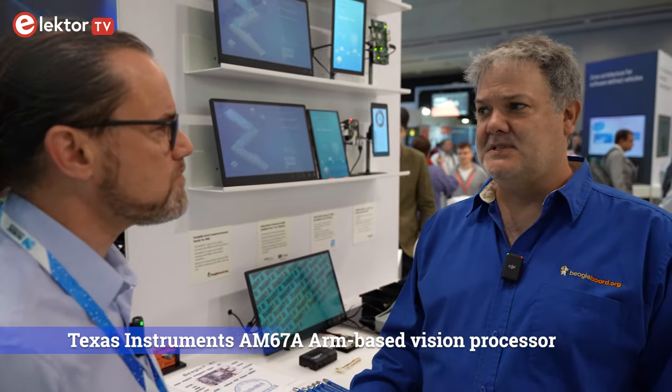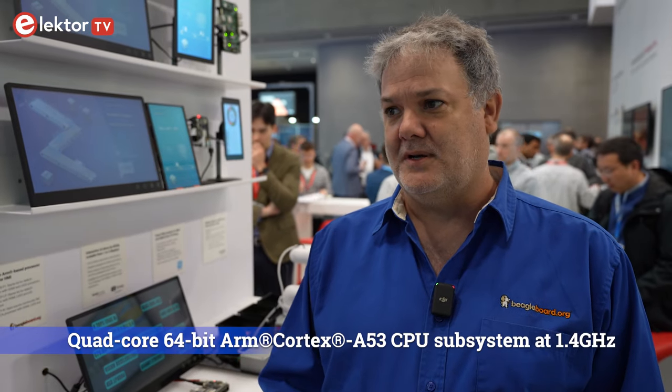At the center of this board, what sort of processor are we talking about, and how does the AI support it? So it's based on a Texas Instruments AM67A system-on-chip processor. The main ARM cores are Cortex A53 — it's a quad A53 — but it includes a couple of C7 DSPs with matrix multiply accelerators that give you up to four trillion operations per second of neural net application performance. There are also R5 processors on there that give you low latency IO and real-time control within the system.